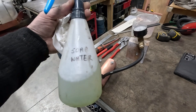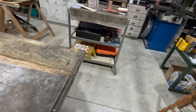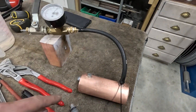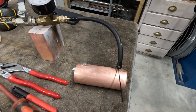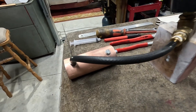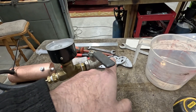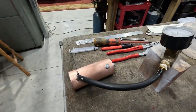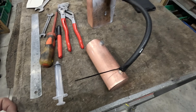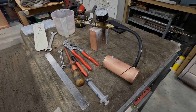I've sprayed around the air hoses with a bit of soapy water - I have to be really careful because I've also got a bottle of WD-40 in a similar bottle and I have picked up the wrong one before. No bubbles though. It definitely leaks from the hose if I move it, but it's been sitting there nearly 25 minutes now at 60 psi, so I'm going to call that boiler good. I might leave it overnight - there's no reason not to - just to see what it ends up at in the morning.